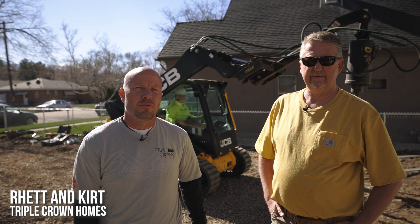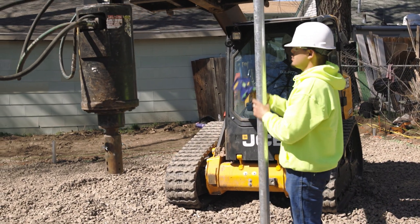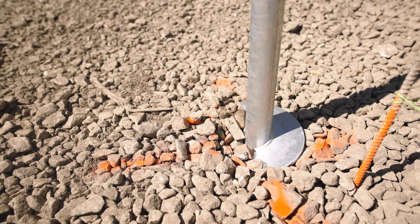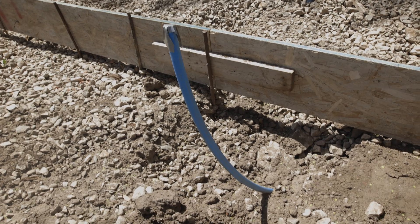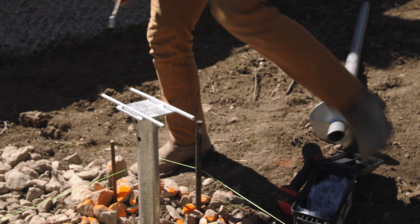My name's Rhett and this is my partner Kurt. We own Triple Crown Homes. Whether the soil required it or not, we would have used this technique now that we've been doing it for two and a half years because of what it saves us. We order concrete once — there's no separate pour for footings, no waiting for footings to dry to put a foundation wall on top, no waiting for the foundation to dry to backfill. With this process, we're formed up before plumbing. As soon as underground plumbing and steel is inspected, we pour one time. We're literally able to frame in a day or two instead of digging the hole, waiting for footings, foundation, backfill, underground plumbing, and flat work. We do it, it's done, and the framing crew can move in. It's a significant time savings on the right project.